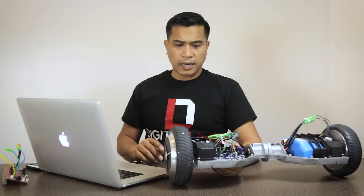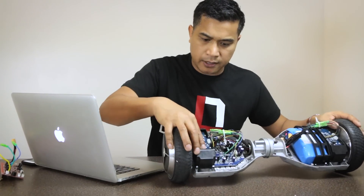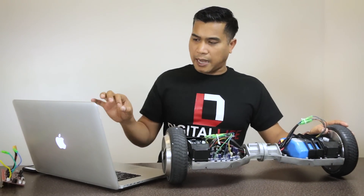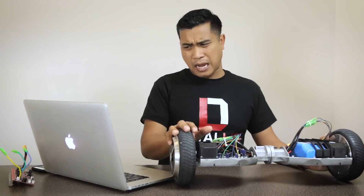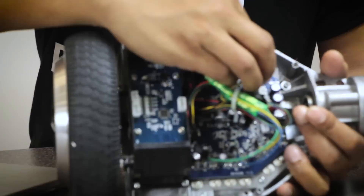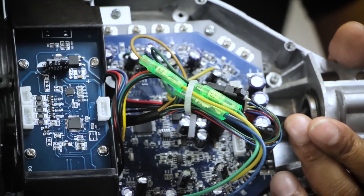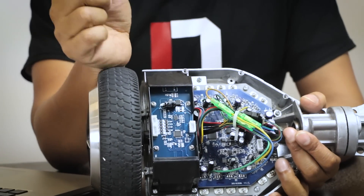It sounds like when you turn it on, there's a chip right on top — there's a Wi-Fi remote option up here — and using Bluetooth does sometimes get in the way of the power button. But it sounds like you have a disconnected wire on your power button. There are two black and red wires from the power button that go to the main board, and if that wire is severed you won't be able to turn on the board. Open your board up and you might find a loose wire, and that should solve your problem.